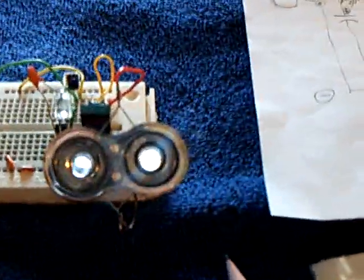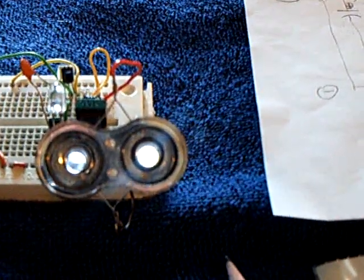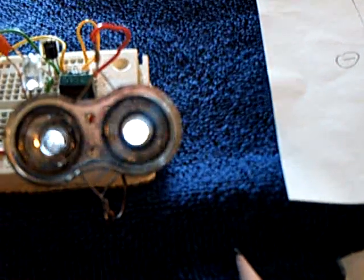That's the voltage on this supercapacitor right now — it's just kind of sitting there. This is drawing less than a milliamp right now. These are very sharp spikes coming off the oscillator, very short duration — tall spikes with short duration. The end product is it doesn't drain very rapidly. But if I crank up the gain on this circuit, I can make these come on very, very bright — but it's eating up my juice. If you want real bright lights, you're going to pay for it.